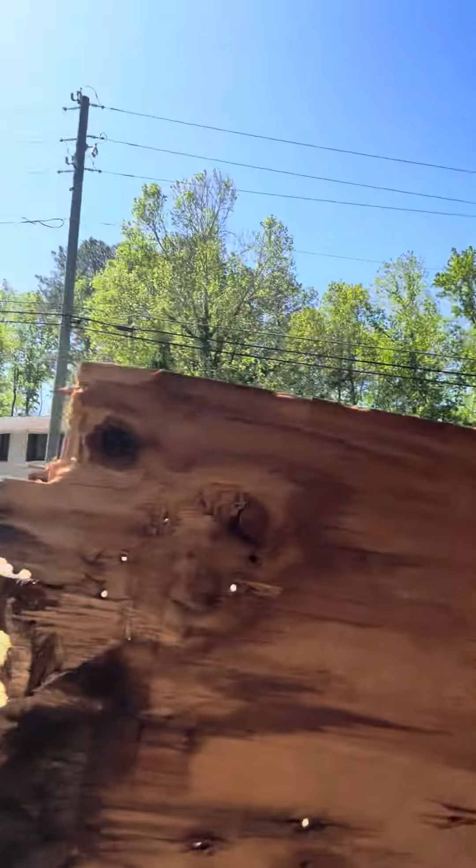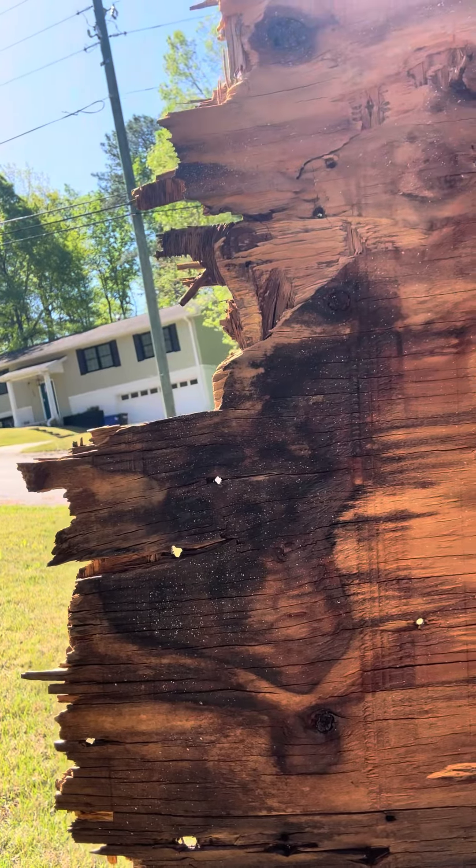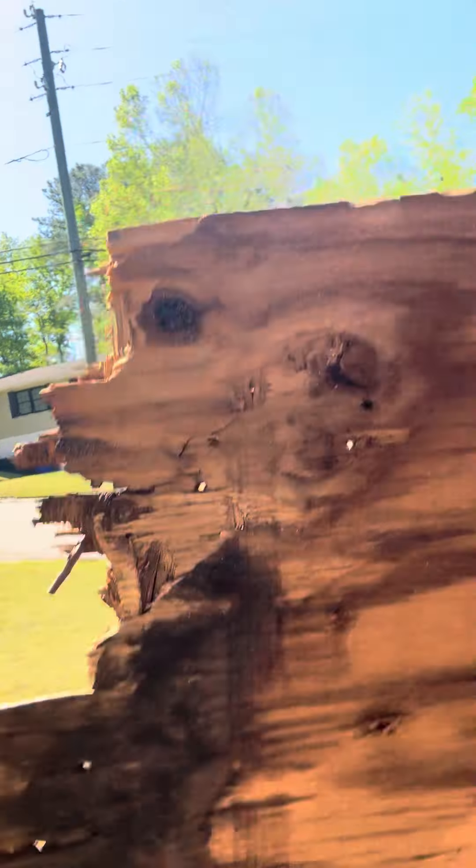You can also see why it's important to have your decking inspected while you have your roofing put on — because you can see the water stains here. This roof has leaked in the past, actually had several leaks. You can see the water staining that's on there.